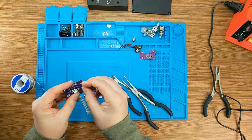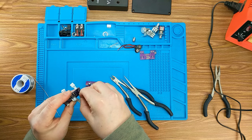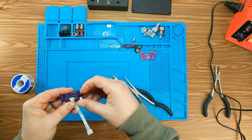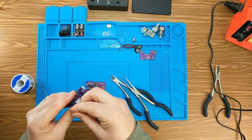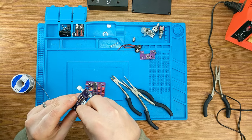And essentially what you want to do is just blue wires, or blue part of the wires facing out, feed it down through, and then feed the bare wires back up through and solder them from the top. This is just basically for strain relief, I'm guessing. Probably should know that if I would have read the manual, but I'm quick browsing it, so bear with me.